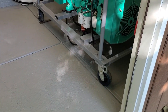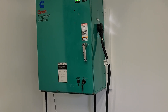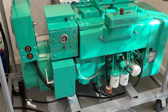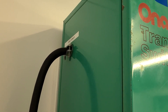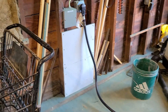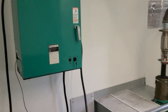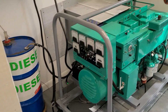Basically, if we have a power outage — which we're going to simulate — in the basement I have interlock devices on two of my services. When we do have a power outage, we're gonna lose power, no question about it. The generator will start up automatically. This cord right here goes up into the ATS — this is actually the grid power, connected to a 50-amp MIG welder outlet that runs underground to the house. Once I lose power from the house, the ATS is gonna sense no power, and if all is working well, it'll go through a sequence and start up the generator.